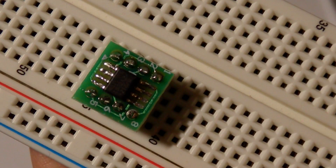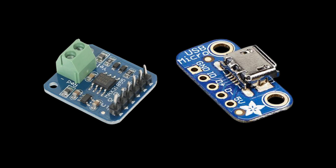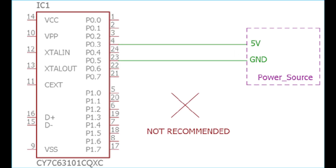All of that was just context for what I'm doing in this video, which is making my surface mount components breadboardable. This is so that I can test my circuit design on a breadboard, deconstruct it if I have to change anything, and easily test the feedback between what I'll be coding on our ESP32. What I'm making is essentially called a breakout board for my components. A breakout board is a board that makes it easier to connect to all of the pins on certain components, like your surface mounted ICs or your sensors. Some breakout boards even have extra components such as filtering capacitors or pull-up or pull-down resistors that are needed by the main component to have it run safely or properly.